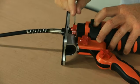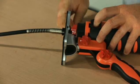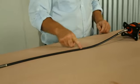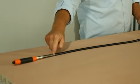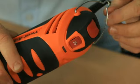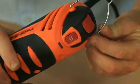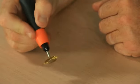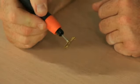To attach the Twister Flex to the main body of the Twister Saw, use the locking nut and collet provided. Always keep the Twister Flex as straight as possible for maximum torque and power. Never bend the Twister Flex shaft to a diameter of less than 150 millimeters when operating, as overheating can occur. It can be laid flat on the bench using the handle or hung up using the latch at the top of the saw. When using the Twister Flex, hold it like a pen and adjust your speed for fast and easy use.